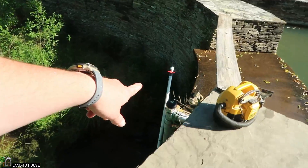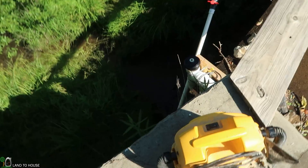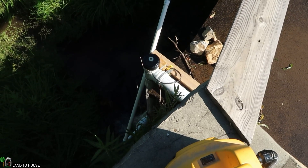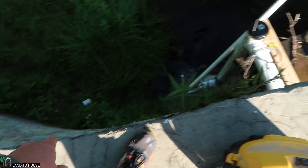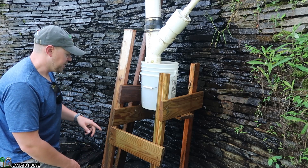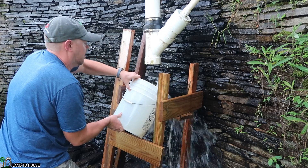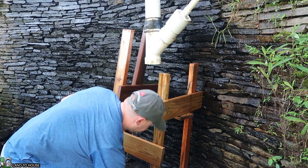What I'm doing now — I've got the water flowing through the siphon to lower everything here so I won't get wet whenever I am repositioning everything down here. We're going to add an additional six-inch pipe onto the four-inch pipe and that should hopefully increase our pull and speed of the turbine. I'm going to step down there real quick, pull out the bucket and drop our whole system down on our little wooden structure to support that piece. I need to pull this bucket and bring all of this down so that my six-inch pipe can fit onto this piece right here.